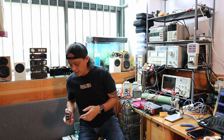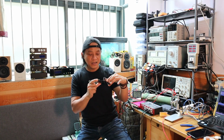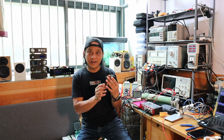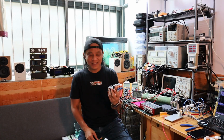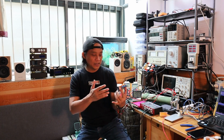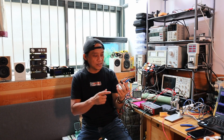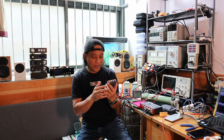The other point I'm going to make is to understand the chemicals used in the processing. Did they clean it? Is the solder lead free or not? In the case of this board, it's hard to tell which solder paste they're using. Why I mention lead free is that, according to the directives, lead is a restricted hazardous substance, so it will have an effect on human users like me as a DIYer, especially since this board is just a bare PCB and exposed, so I can touch it, probably rub my eyes, go to other things, and get some kind of effect.